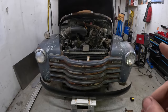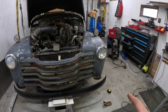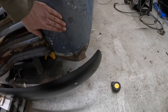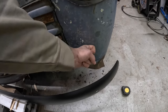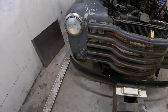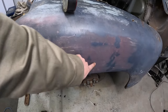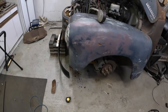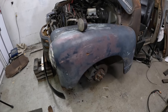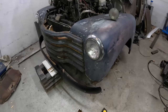I have both those braces in. It's way better measurement wise for the bumper — it's a lot closer. I am realizing how bad that fender damage actually is. I thought it was just kind of rusted in the bottom, but the whole thing's kind of folded in. You can feel it right around here — it starts folding in and actually pushes this part out and sucks this part in. So it's going to take a lot of straightening to get it nice and flat like that side. I don't want to put a lot of time into fixing that until I really dig out all this Bondo — I could see from the inside it's got a nice crease that someone just Bondo'd all over it. But I'm not going to do that until I'm close to ready for epoxy and then I'll strip everything down to bare metal. So I think that's it for the front bumper — I don't think I want to mount it until the body is actually in a lot better shape.